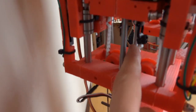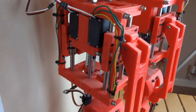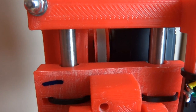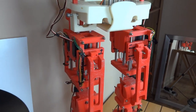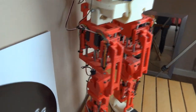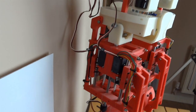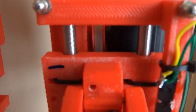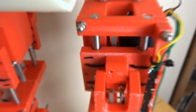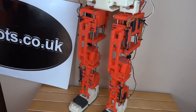The actuators are also driven by these belts, rather like a 3D printer. I could only get 5mm belts in there because the previous approach was to use ladder chain, and there isn't space on each pulley for wider belts — there are some constraints in the mechanism that was built for chain. There's a bit of stretch in them, so I'd quite like to upgrade to 10mm belts. I also think I can get the actuators into a smaller space, so I quite fancy a redesign of the linear actuator to make them more streamlined with thicker belts or a stiffer mechanism.